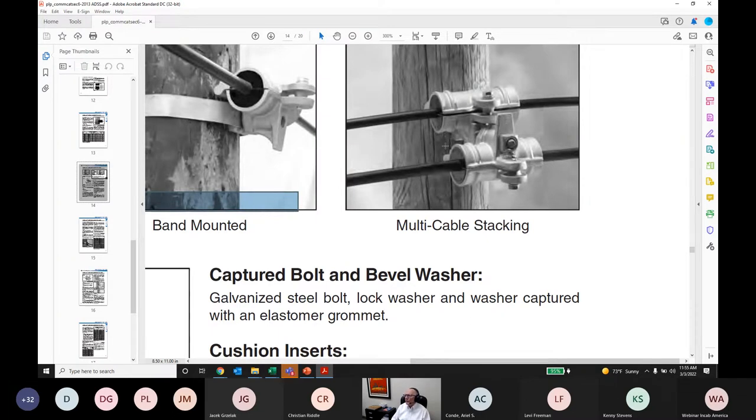But I would be careful to make sure that the two cables are reasonably close and sagged reasonably the same, so that you wouldn't get any kind of mid-span clashing. Obviously, that's a potential problem as the span length gets longer. These days, the sag and tension programs that are used, in particular PLS CAD, will do a clashing calculation for you. If you have any doubt about it, set up your ADSS cable in PLS CAD and check for clashing. That's my only concern there.